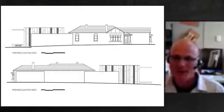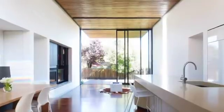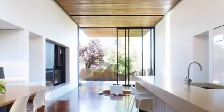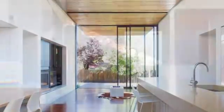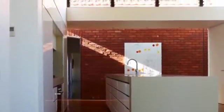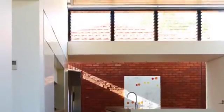So as a building warms up, before the room warms up, we've got to warm up this thermal mass. So in winter, when you fire up a heater, it might take 2 or 3 days to warm up this inner skin of brickwork. And then once it is warm, when you turn your heater off, that will just subtly radiate back into play in maintaining a temperate temperature inside. Conversely, in summer, those bricks are providing a barrier in absorbing heat before it's emitted.